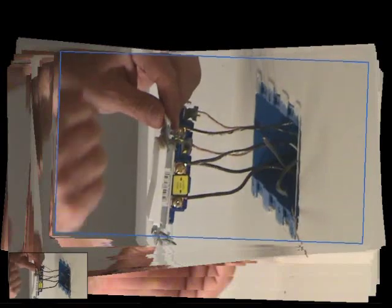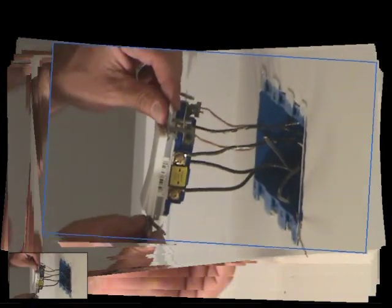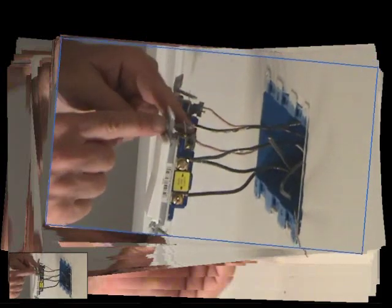before tightening up the screws. You don't want to get it about an inch away from here and say, I'll just put the screws in and ram it in there. Because if something's amiss back there, if it won't go in any further, these screws are not going to pull it tight to the box. This is only a plastic box, plastic threads. You could strip out the threads out of the box, first off. Or secondly, you could start pulling apart or bending the flanges and that kind of thing on your light switch. So make sure you get it pushed in there and up tight first.